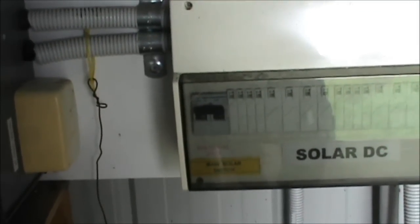Then we go on to the inverter. This is a 3.5 kilowatt pure sine wave inverter. It's got monitoring LED lights on there to tell you the state of the system, what's happening with it. And also a reset breaker here, so that if for some reason the inverter is overloaded by an appliance — or as John said, if you try to use electrical equipment in the garage — it's an automatic shut-off so you don't cook the inverter. Out of the top of the inverter, that's 240 volts AC.